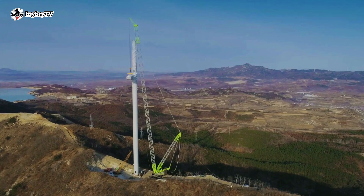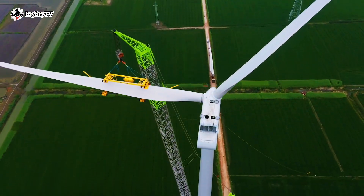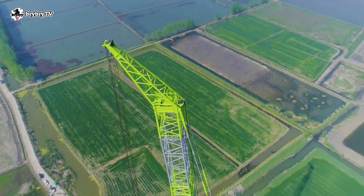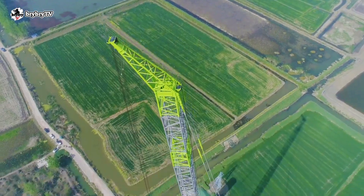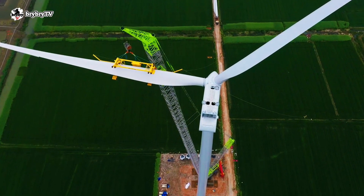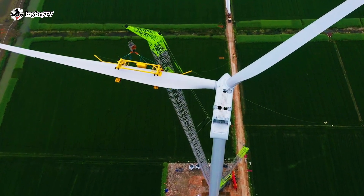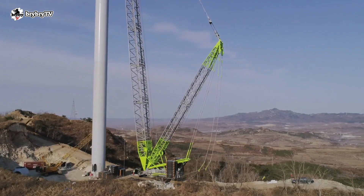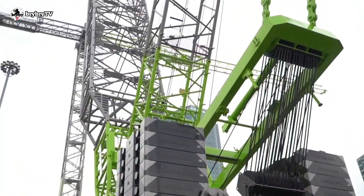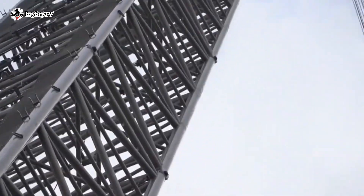The max weight of a single part is within 44 tons. With a unique design of wind jib, modular and lightweight design of 171 meters plus 7 meters, the combination can be assembled within 24 hours. The Zoom Lion ZCC 9800W is the first super-long multi-variable boom combination in China with a super-wide boom, up to 171 meters plus 7 meters.